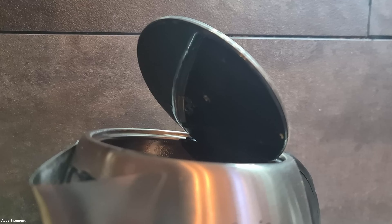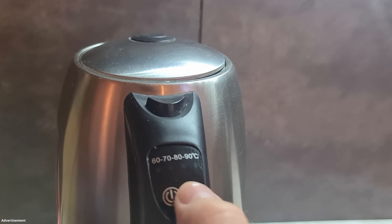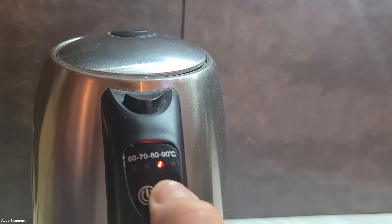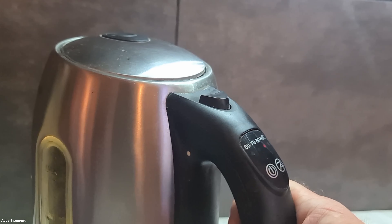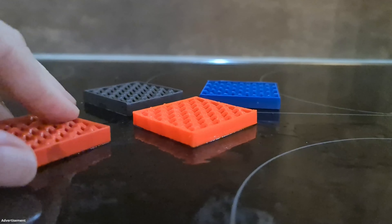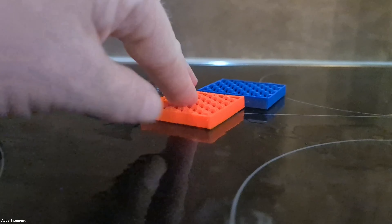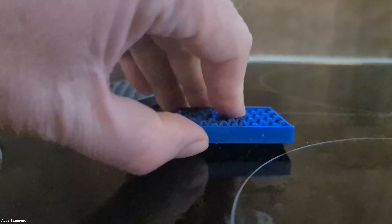Next round — all parts back in the kettle. This time I set the temperature to 80 degrees. In the case of PLA+, no further changes are visible for both post-crystallized and non-post-crystallized. PETG has also remained unchanged, and also ASA and ABS — no change recognizable.